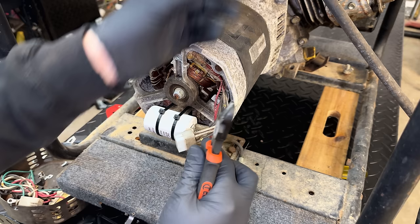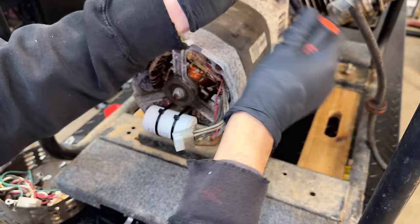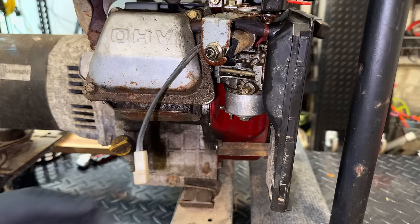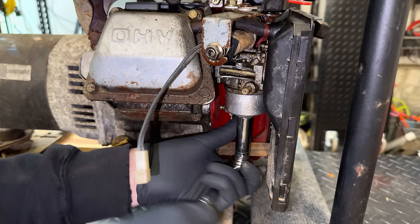You know, for now, I'm just going to cut off this line because it is fairly petrified. It should be replaced once we know we have a good machine here. You can tell someone's been in here at some point because the drain is on the wrong side. It should be over here, and being where it is, it can't actually access that screw to drain out the bowl. So I'm going to crack the bolt on the bottom loose, try to rotate that bowl around, and then drain out whatever might be in there.